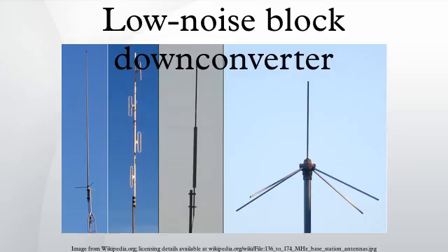It is common to polarize satellite TV signals because it provides a way of transmitting more TV channels using a given block of frequencies. This approach requires the use of receiving equipment that can filter incoming signals based on their polarization. Two satellite TV signals can then be transmitted on the same frequency and, provided that they are polarized differently, the receiving equipment can still separate them. Throughout the world, most satellite TV transmissions use vertical and horizontal linear polarization, but in North America, DBS transmissions use left and right hand circular polarization. Within the waveguide of a North American DBS LNB, a slab of dielectric material is used to convert left and right circular polarized signals to vertical and horizontal linear polarized signals.